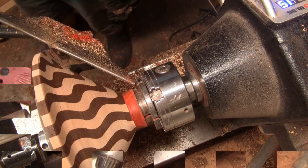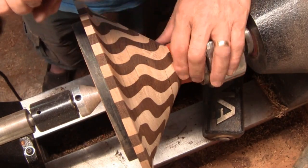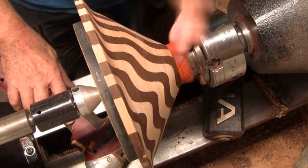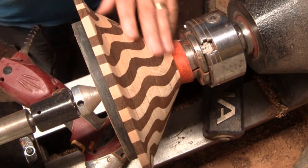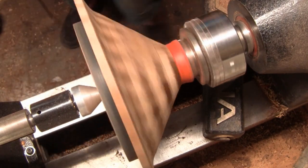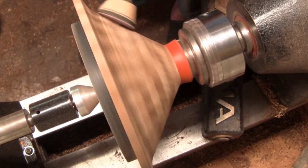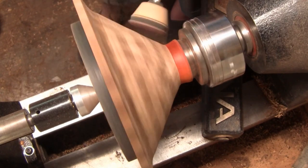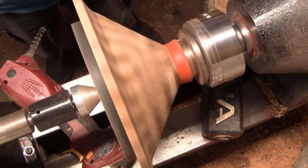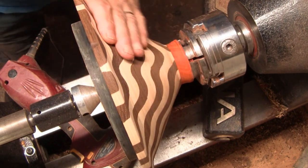Okay, time to sand. All right, we're all set to sand the outside. It's going to be the same thing. 2-inch disc, starting with 80 grit, going through 400. And I'll be going in reverse this time, around 375 RPM. And I'll get my dust collector going, get a mask on, and I'll start sanding. See you when it's time to get the finish on it.